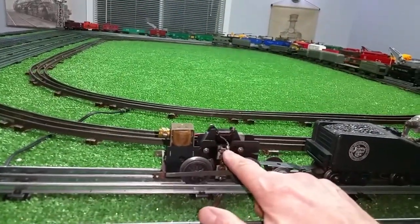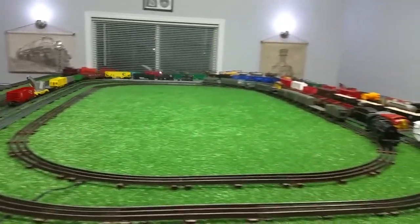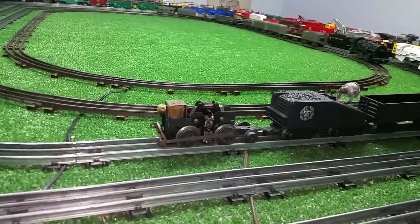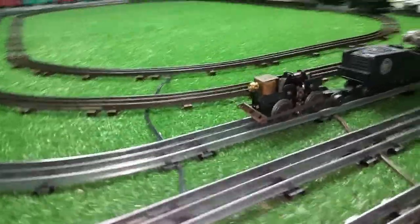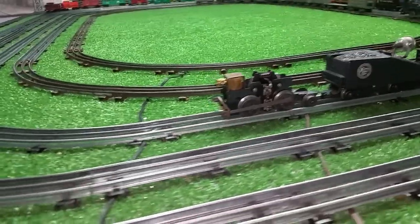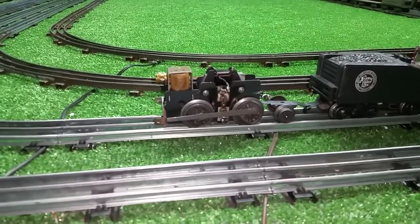I also had to re-solder the wire on the brush plate itself, but the nice thing is it fixed it — it's running. It was a really interesting repair, so I wanted to do a quick follow-up video. The Canadian Pacific is on its way back; it was here for a grand total of five hours. I re-soldered the connections and this thing is up and running. You've got to have a meter to test those coils. As always, feel free to drop me an email at BenZTrainz@gmail.com. Thank you for watching.